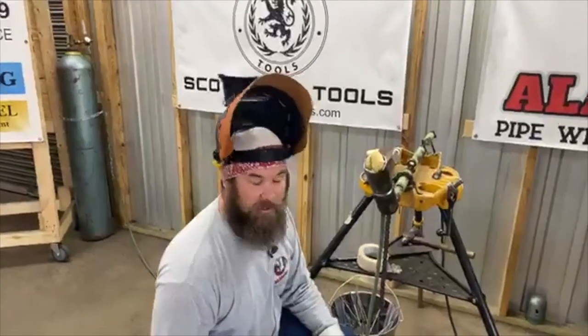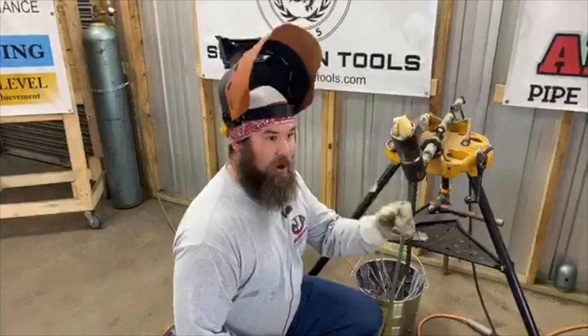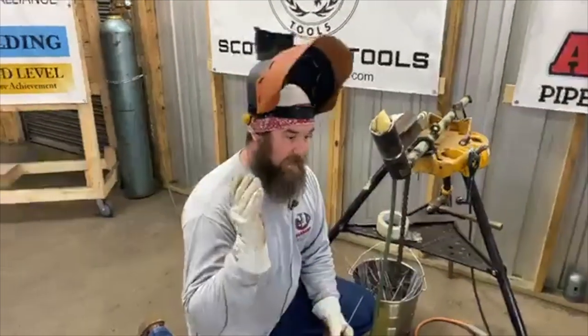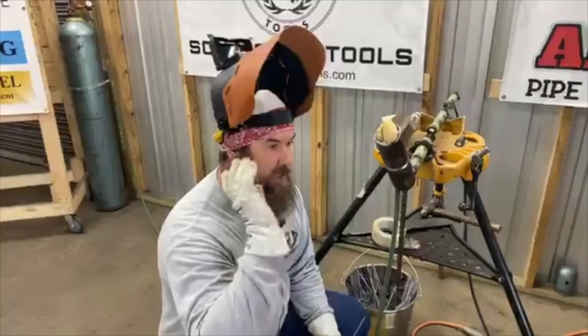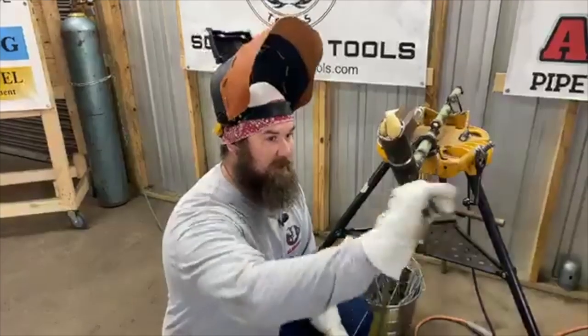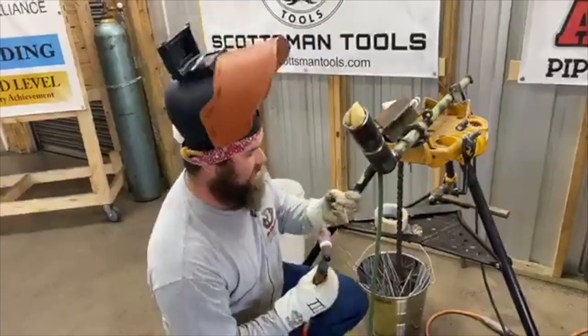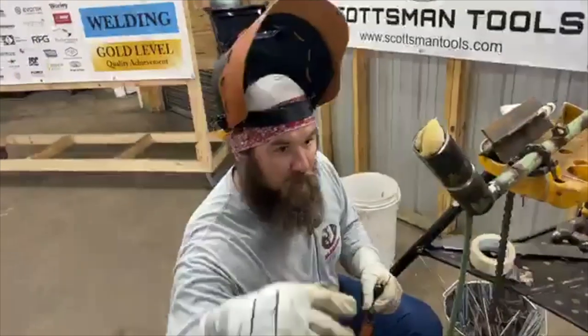It's cheaper for companies to give qualifiers on this. You also have situations where you weld carbon to stainless — if you're running a system and have a valve that's stainless, depending on what alloy it is, you might have to go from carbon to stainless then to the valve. It'd be downstream from wherever the critical area is. The stainless and chrome have corrosive-resistance properties — they might be adding certain chemicals in at a certain point through a Y fitting, and then you can use carbon downstream.